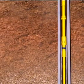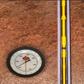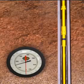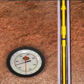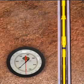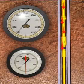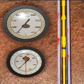The drill pipe will now be picked up to verify that the setting tool is released. We expect to only see the weight of the drill pipe on the weight indicator since the liner is now being supported by the liner hanger. We only pick up a couple of feet as we do not want to activate our packer setting device yet. Once we have confirmed that the setting tool is released, we slack off and circulate to verify our pack-off integrity. We must slack off enough to overcome upward piston forces on the bottom of the pack-off.